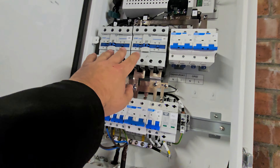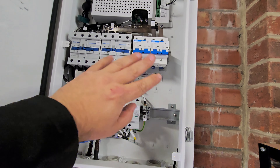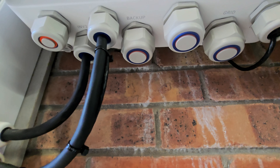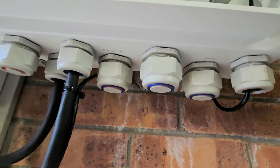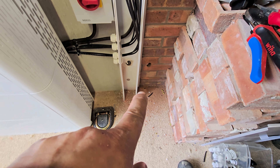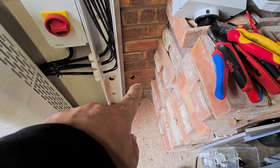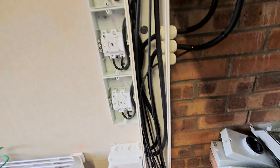Once you've got the two contactors up there, they pull in and out based on what's going on with the grid and the smart port. All of these stuffers on the bottom are absolutely brilliant — they have loads of little pullouts, so depending on the size of the cables you're going to use, you've got options. We've got holes through to outside — we're going to bring our strings and comms through one and then our steel wire armour sub-main through the other. That's going to come straight up into the gateway, nice and neat with a bit of separation.